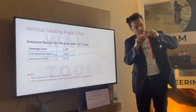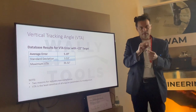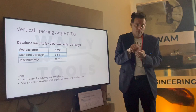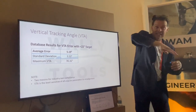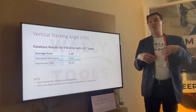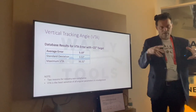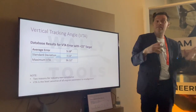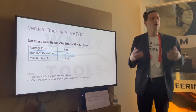Because you've created some material underneath the cantilever, you now have to offer clearance between the bottom of that yoke and the record. So that limits your ability to get much material on there and get your cantilever angle down. So how do they make the situation better for themselves to make a higher output cartridge and get more material underneath the cantilever? Well, they raise the cantilever angle. Makes it easier to build a cartridge, all right? So, but at what cost?